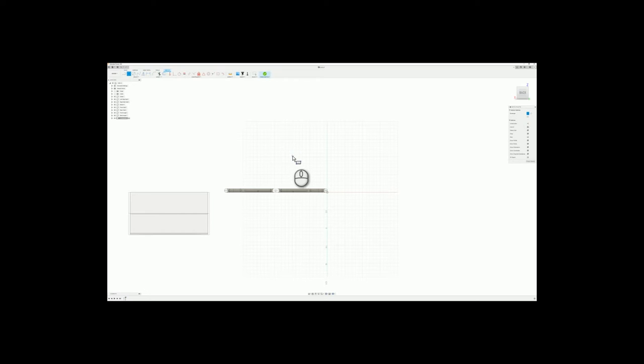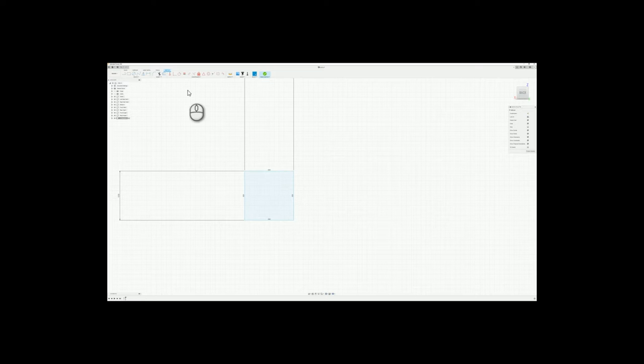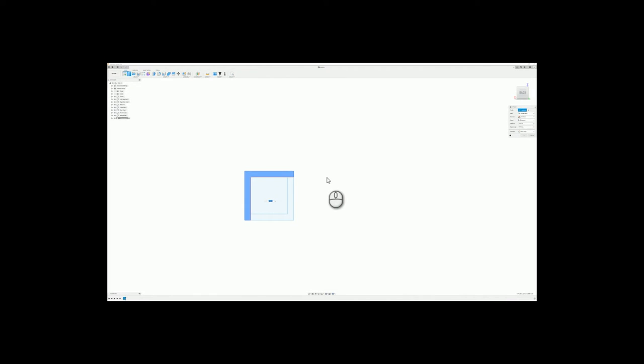This is just going to be a simple part, doesn't really matter. Just make it a square for now. We'll do a half by half. What we'll do then is use the offset tool. That's too beefy, so let's divide that by 4, maybe 2. There we go. Draw some lines to connect this to this. Extrude it out. That's going to go 11.